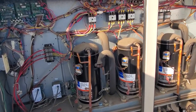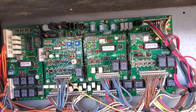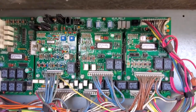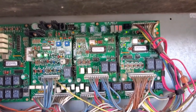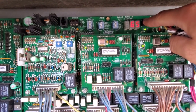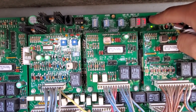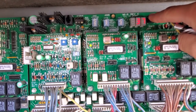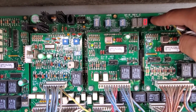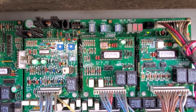This is just a standard 15-ton Lennox unit. There are no error messages on the board. The first thing I want to do is look at the temp sensors. The unit has onboard temp sensors — it does have a conventional thermostat, but I want to see the temp sensors. So we've got one saying 70, one saying 65, one saying 72, one saying 37. I'm not sure why this one doesn't show me what the sensors are for. Another reads 45. I'm going to have to open up the manual and see which sensors are which.